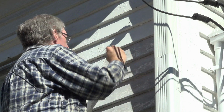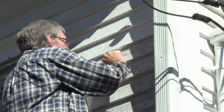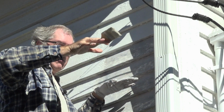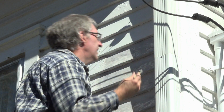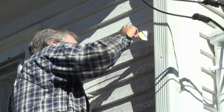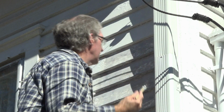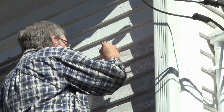Now, oil-based paint, because it takes so long to dry, will actually flow out. So if it's uneven, it'll flow out and become flat and smooth. And that's one of the great characteristics about this paint. Latex doesn't do that. Modern latex paint has dryers in it, which makes it dry fast. So whatever you get in terms of brush strokes is what you're going to get in your finished product.